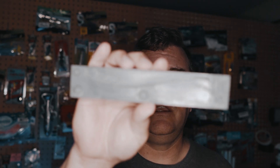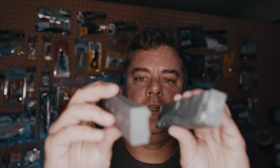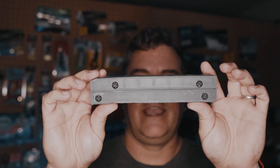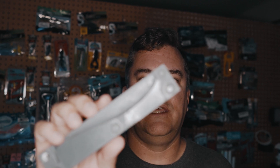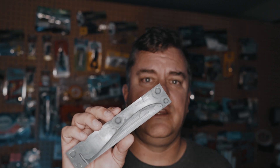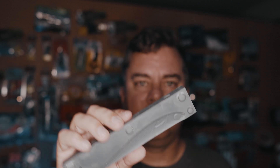Here's the mold I'm going to be using today. It's really high quality with lots of detail. It's two-part, has registration buttons in there, and it goes together relatively easily. I am going to have to clamp it together to get that gap out of there. I had to do a lot of sanding and drilling to get these holes open. I'm not really good at printing this resin yet — I think I overcooked it and lost dimensional accuracy, so I had to sand down these registration marks to get it to fit together. We're going to be clamping it up and we're going to be pouring it.